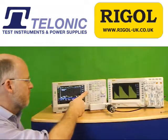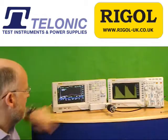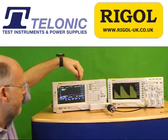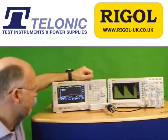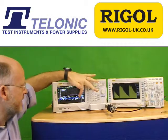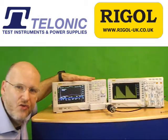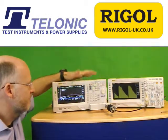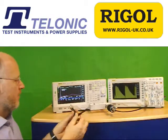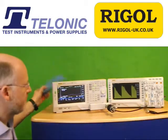I'm going to push one button to measure the VSWR across the whole of that range. Within half a second I'm getting a readout that shows me at 500MHz this load has got an SWR of about 1.23 to 1. There's the tabulated readout — the 815 is doing all of the calculations for you. It provides a very convenient readout, and you can explore all kinds of antennas with this system simply by attaching them to the front of the bridge.